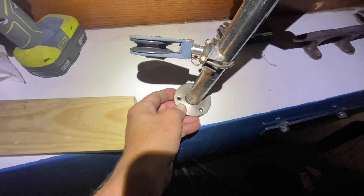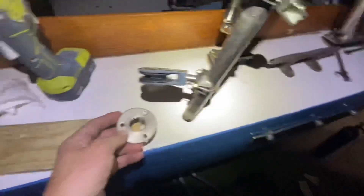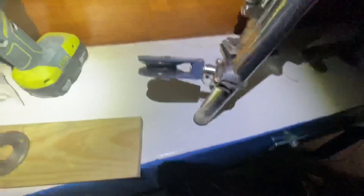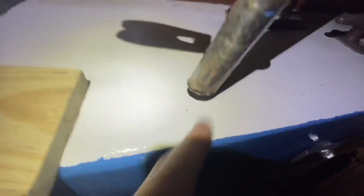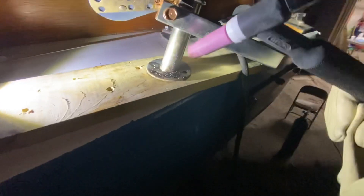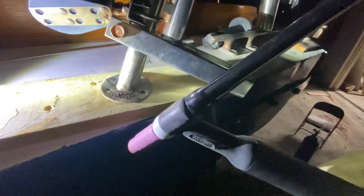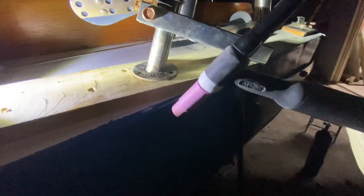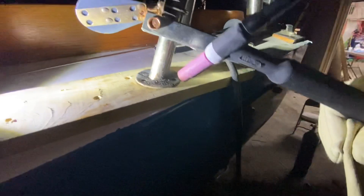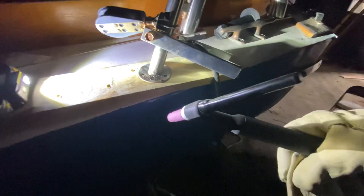This stanchion base broke off as I was moving it to paint the deck, so I'm going to try welding it. I got the welder set up but first I'm going to clean up this edge a little because TIG welding likes everything to be super clean. I gave it a shot a couple of times and it just went all over the place — seems like a lot of contamination. Maybe this metal isn't weldable, or my welder might not like working on 110. I'm getting nowhere with this, just making a mess.